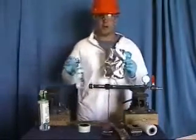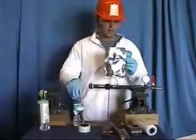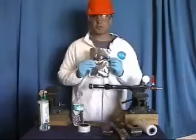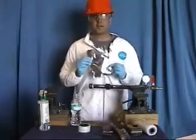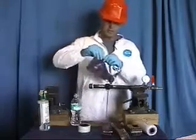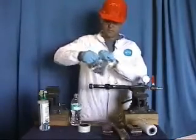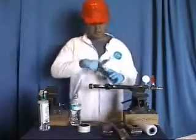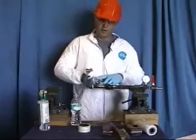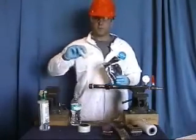In order to apply the composite wrap, we'll need water. We have access to water. Before opening the pouch, ensure that you have water, because once you have opened the pouch, you have activated the materials. Fill the pouch with water. Inside the pouch, we have our composite wrap.